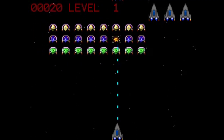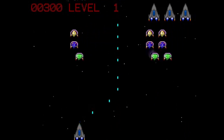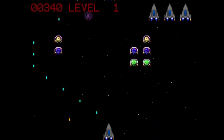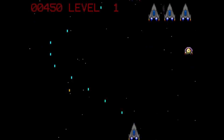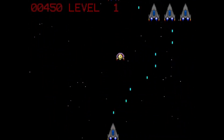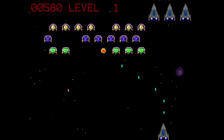For the graphics, I've reused the frame buffer from the Pico Planetarium. It allows you to draw text, graphics primitives like lines and squares, or even images to a buffer stored in RAM. The game sprites are images stored in flash — they get transferred to the frame buffer every frame, and at the end of each frame, the frame buffer is transferred to the display.